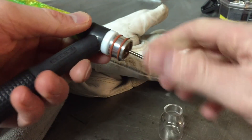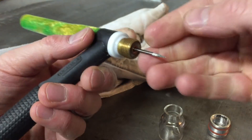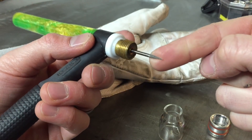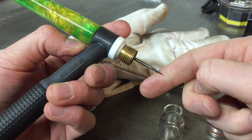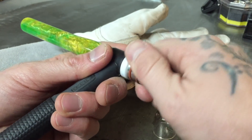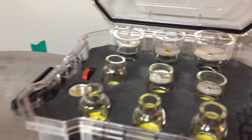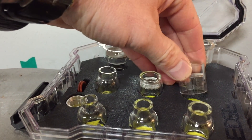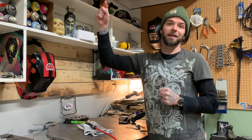For torch setup: I'm running a 3/32 gas lens setup with a wedge collet/collet sleeve on the inside — those are my favorites. Our tungsten is a 3/32 laser tungsten from CK Worldwide. These are probably my favorite tungstens lately — they work so well at low amps, they snap up really clean, which is great. I'm using the adapter system from Edge Welding cups, which threads over an existing gas lens so you don't need extra hardware. I'm going to be using a number eight size Pyrex cup — nothing too fancy. Shout out to Edge; they've got lots of options including long cups, standard ones, and short micro cups. Links in the description below.